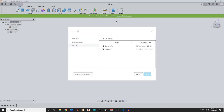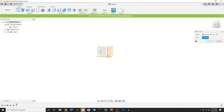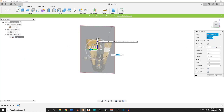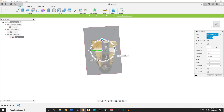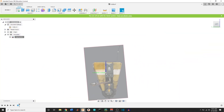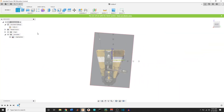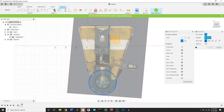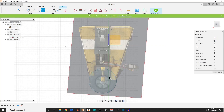Here in Fusion 360, all I'm doing is adding an image to the side view and importing it. What's really cool is you can calibrate it, but before I do that I'm gonna make this a little easier on myself and move the image to where it's more vertical — straight up and down. Here you can see me move it a little bit, not quite exact but close enough, and then I'm calibrating it and typing in 36 inches. So now we have the height. What we can do with this now is add a sketch, create a circle, dimension that circle, and see how big that wheel really would be if it was life-size. We get 13 to 14 inches, which falls within a good number.